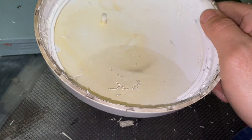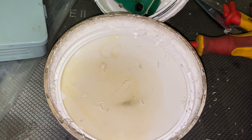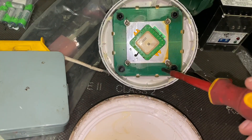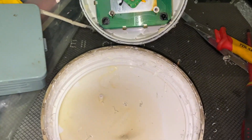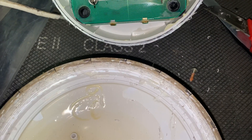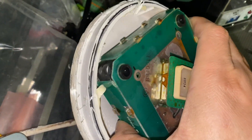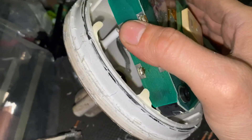I'm planning to dismantle the whole thing and put it in the dryer room. I am hoping that once it gets dry, it will still work. We just need to remove these four screws to dismantle the antenna unit. Do not forget to put markings on the orientation of the antenna, as it needs to be facing forward during reinstallation. So I put the antenna into the drying room overnight to dry the whole thing.